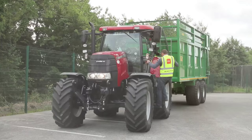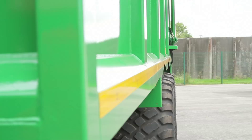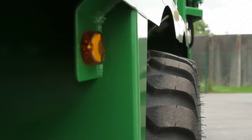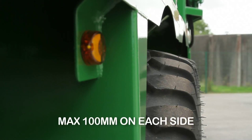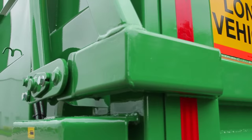The following items don't count when measuring the overall width of an agricultural trailer: the projecting part of flotation tires and mud guards protruding beyond the bodywork, up to a maximum of 100 millimetres on each side of the vehicle, and devices associated with hydraulic rear door opening mechanisms.